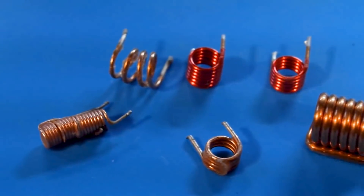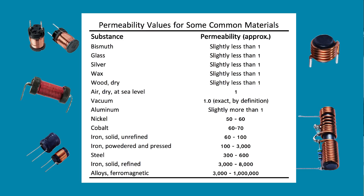While some inductors have air cores, we've learned that using cores made of materials with higher permeability can help increase the inductance of the coil by a factor of 100 to 1 million times that of air. Let's talk about how this all factors into transformers.